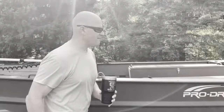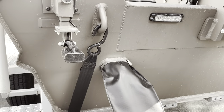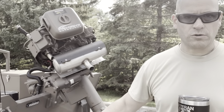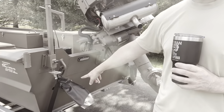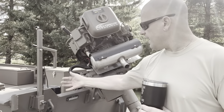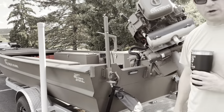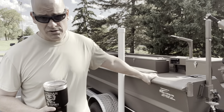On the back of the boat we have these things known as scuppers — there are two scuppers, and here's what the back of the scuppers looks like. It works kind of like a zodiac boat that special operations forces use in maritime operations. The floor of the hull is always higher than the water line, and once water comes in, these two scuppers flow 60 gallons a minute. So you have 120 gallons a minute that will be extracted from this boat automatically using physics — there's no bilge pump or anything else. So if this boat is forced underwater it's going to start pumping that water out of the scuppers and right itself. As far as boats go, this is virtually unsinkable.